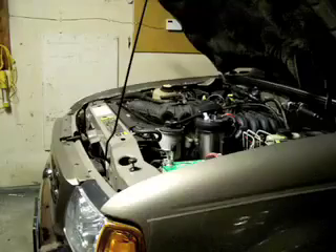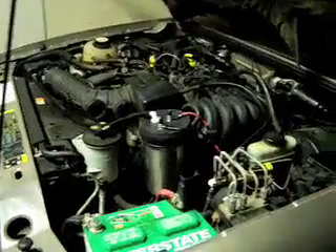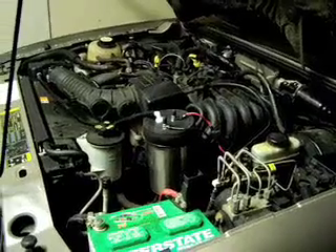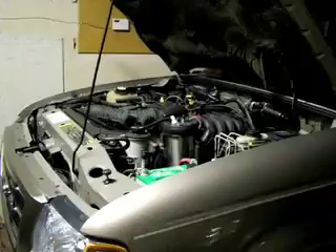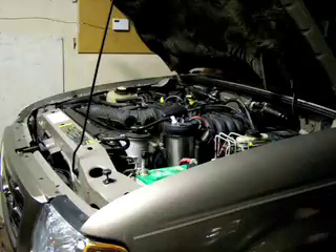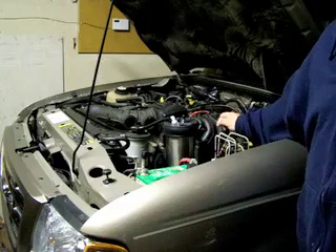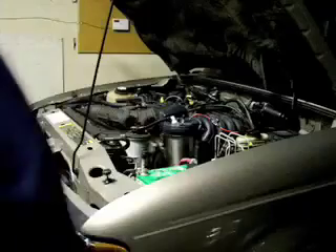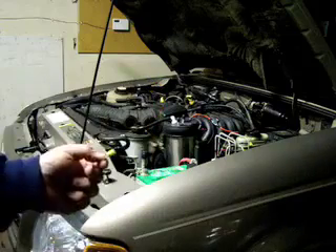I told you I'd show you the one in my truck. Mine looks quite different — I've experimented over time. I have it in a stainless steel canister with the same basic two-spatula design inside, but with insulation so the electrodes can't short against the sidewall. That stainless steel container is bolted to the engine block and grounded. I have mine wired into the windshield wiper motor circuit and also fused. I suggest you secondary-fuse your generator in case of a short so you don't melt wiring or cause a fire. Use proper connectors for a professional installation to avoid loose or frayed wires shorting out.